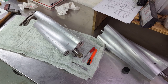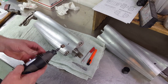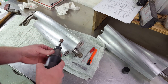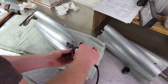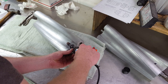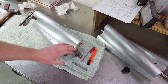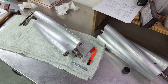The final step in the process is to deburr the hole where you drove the pin in. I like to use a well-worn sanding drum on the Dremel to just touch the edges of the hole very lightly to make sure there are no burrs sticking up that could get caught on anything or touch the other rotor. Very light pressure — just barely brushing the edge of the hole is all you have to do. That feels nice and smooth; my finger doesn't catch anything on the edge of the hole. That's the right way to put pins into a 671 rotor.